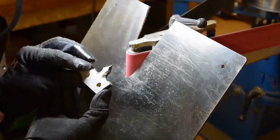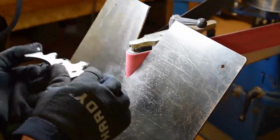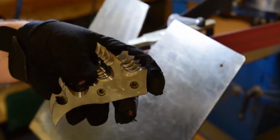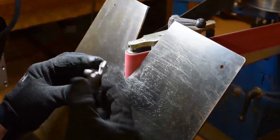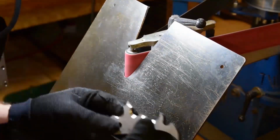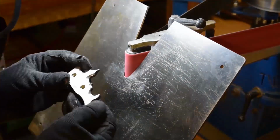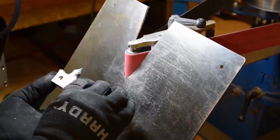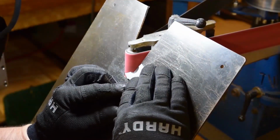These 2 points here, well, the single 1 point, but the grind on the left and the right side, just real touchy to get. A lot of the other grinds can vary a little bit, but where that peak meets, I definitely want the left and the right side to both match. So it's just a little bit of finessing, a little bit of just touching the wheel and then backing it off.